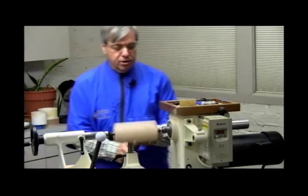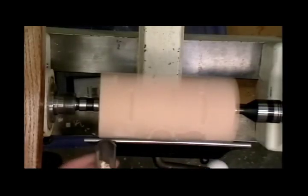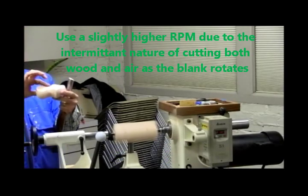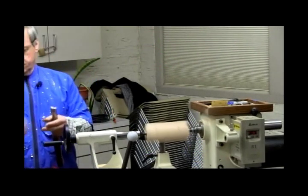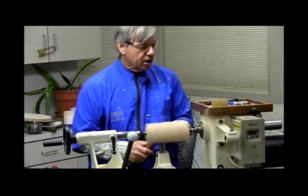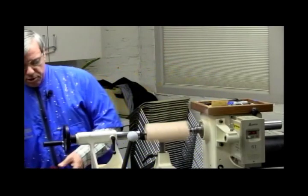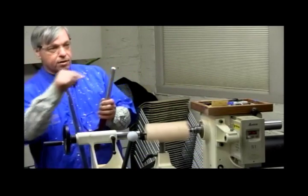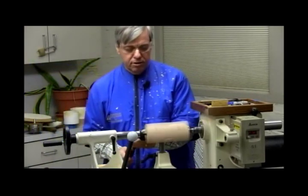So the first thing I like to do is just kind of take a little bit off the top. If you take too big a bite it can be a problem, because as it's spinning around, when you're on this edge it wants to chip out. If you take a big piece out, you're going to get a big chunk — you can see there's a chunk that came out here; I probably tried to take too much there. Some people can use a roughing gouge all the way down. This is a roughing gouge I got from Harbor Freight — it works good. I prefer this one over the regular one for this because I can get details with it since it's not quite as round.